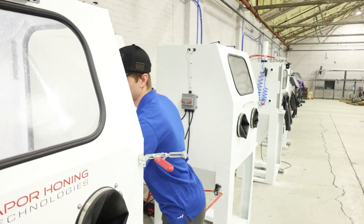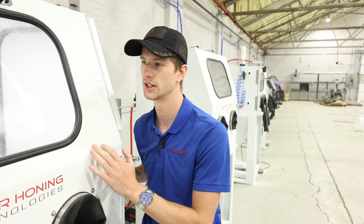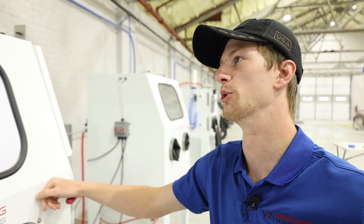We're going to be using the VH-1000. This thing is an absolute workhorse. I've got glass bead in here right now, and we are going to be blasting close to 100 PSI so that it will remove all of the anodize.